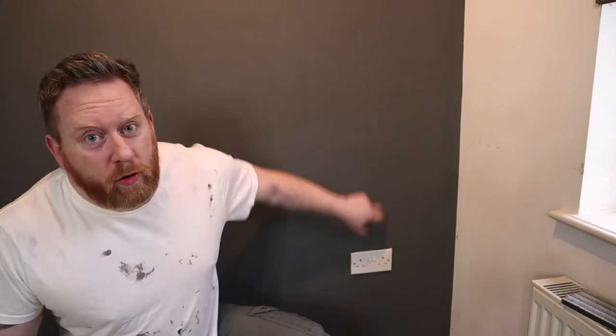One thing to be really careful of when working on a wall with a switch or socket: never drill, cut, nail, or hammer into any of the 90 degrees off the socket or switch — that's straight up, straight down, straight left, or straight right. The reason is obvious: the electrical cables going to the plug will be running in one of those directions. Depending on whether you're upstairs or downstairs can make a difference, but it's always best to avoid those four directions. The last thing you want is to drill straight into an electrical cable and blow the fuse box or electrocute yourself.